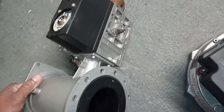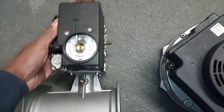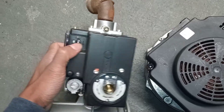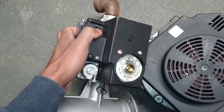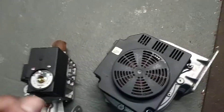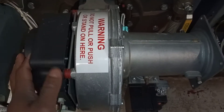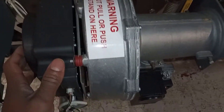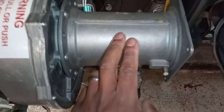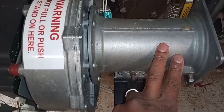Underneath here you have the adjustment cap, and underneath here you also have the adjustment screw. So you can make adjustments to your high and low, and there are test points on here as well. Another test point and places where you connect your leads. And here is the fan in-situ, and the same gas valve and venturi that you saw out of position.